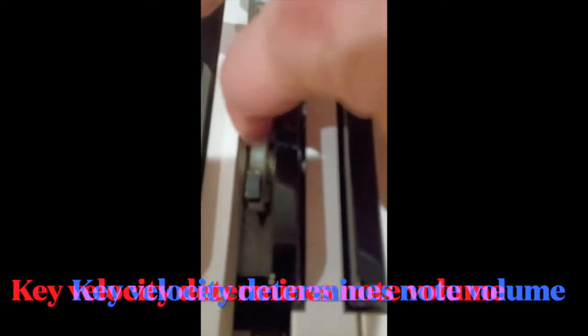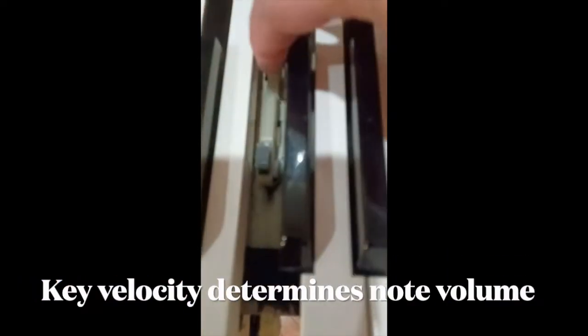Okay, we've just removed the middle C key, and that's what it looks like inside. We'll turn it on and we'll press the switch. Okay, that's how a normal switch should work. So the action causes this to hit the switch. Aha, it's got to be in the right spot on the hole. So that might be something if they're not hitting the hole right.